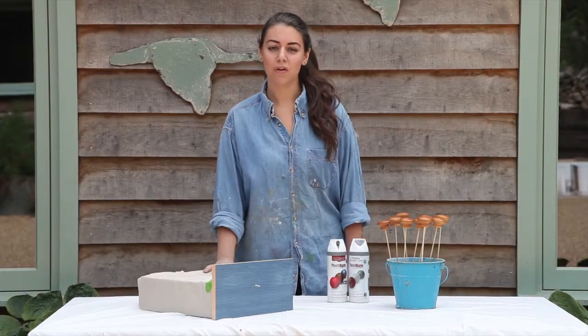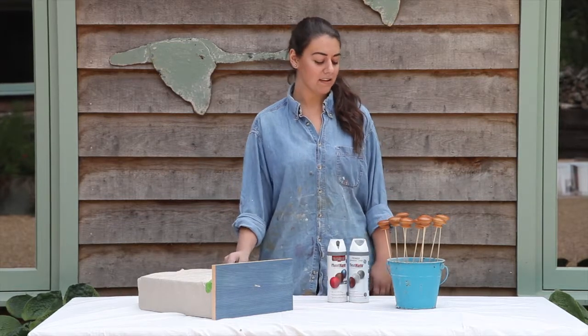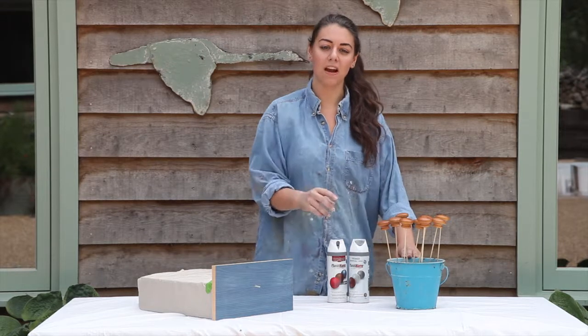I've masked the drawer already for spraying and removed all of the drawer knobs. My top tip for spraying the drawer knobs is to stick them on kebab sticks in some soil — that way you can spray them from every angle.